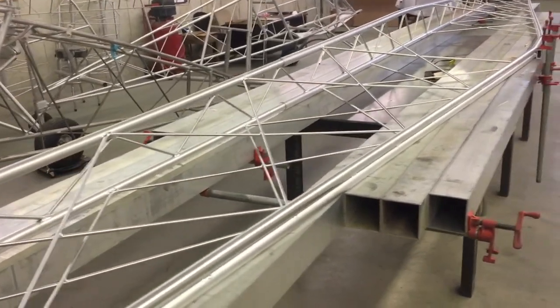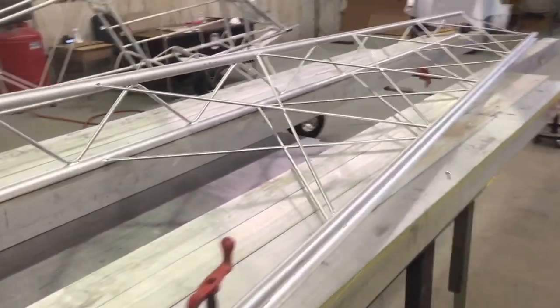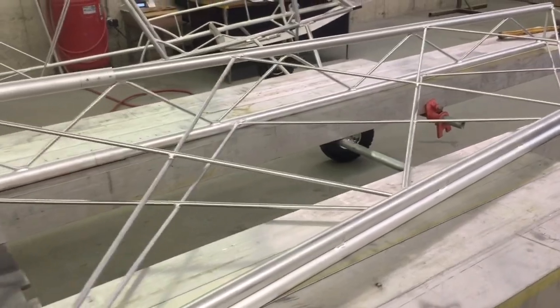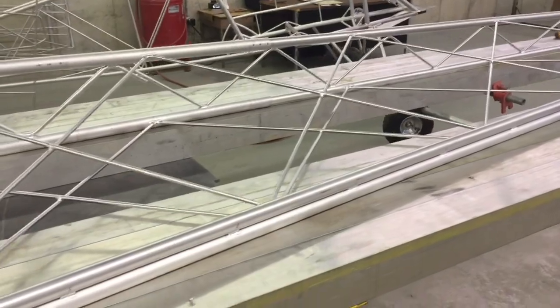Alright guys, I've got all the X bracing done now. I'll get this flipped over and I still got to weld the other side of the X bracing and get it finished up. Once I do that, the next step is to get all the rib material out, get it polished up, get the ribs bent and get them installed. So that's how I do everything up to this point. Watch out for the next video and I'll show you how I get all the ribs bent and installed on the airplane. I'll try to get that up in the next couple days. But until then, thank you guys for watching.